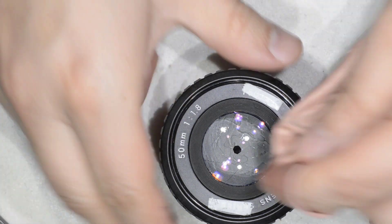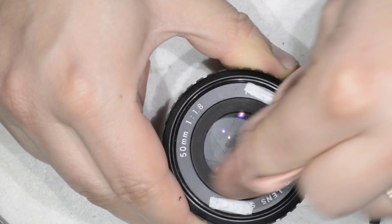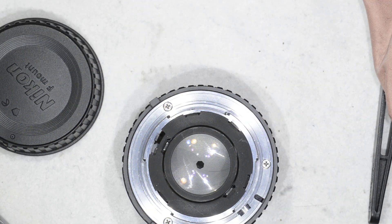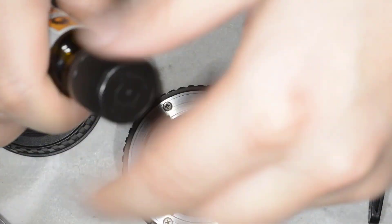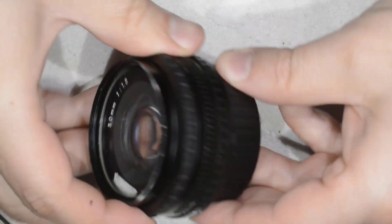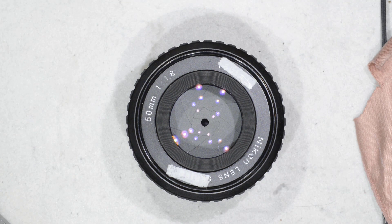And there you are — we got the lens clean in no time. Let us also clean the front and back exterior lenses; I use a microfiber cloth for that. So the front — let me put a filter here — then we do the back. And here you go: we get the lens as good as out of the box. This is all I wanted to show you today, thanks for watching and see you next time.